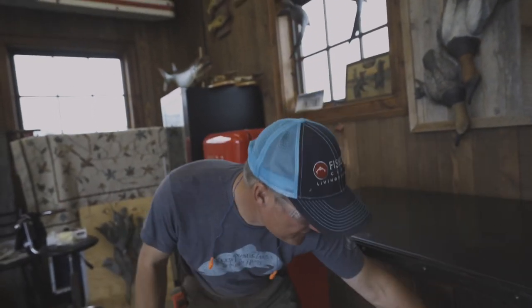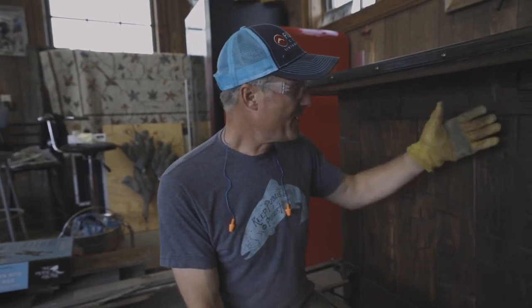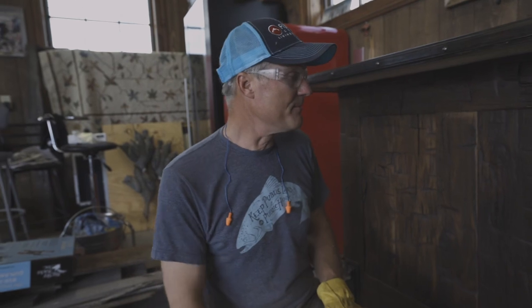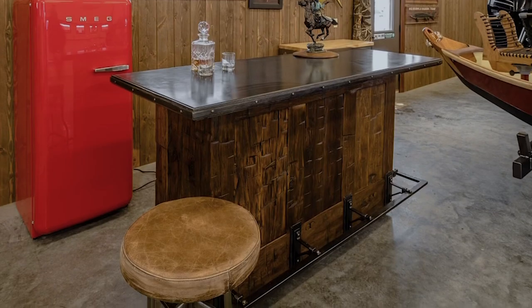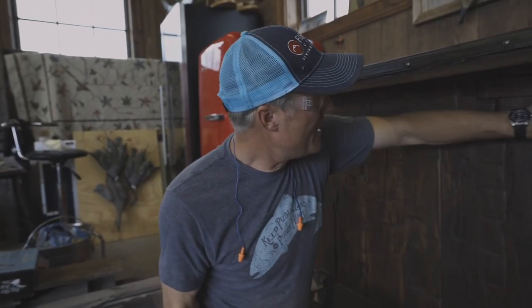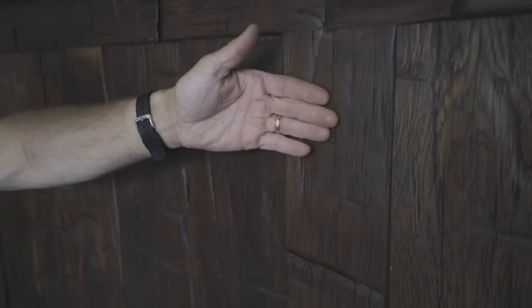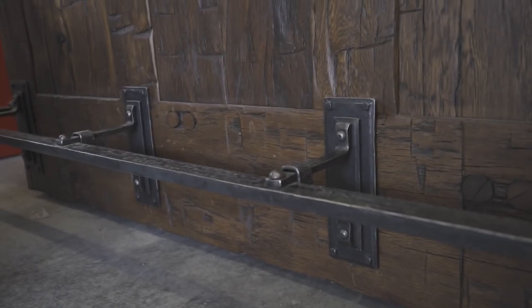This is basically the same material — it's a white oak as well. You can see the mortise pockets that we actually put back in there, because we band-sawed the faces off of four-sided hewn logs, got the skins as we call them, and basically veneered them to this. It's not all that easy, but the point is it was the same really rough material and right now it's super smooth. We eased all of the adze marks, the axe marks, and just softened it for everyday use. We'll probably do the same exact stain and lacquer as we did here — that's what we're looking to match.